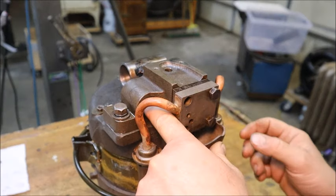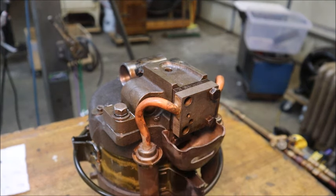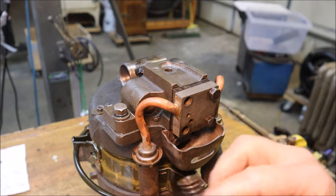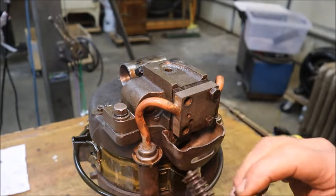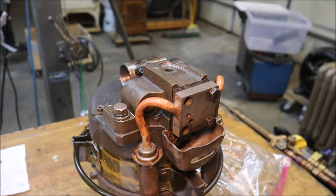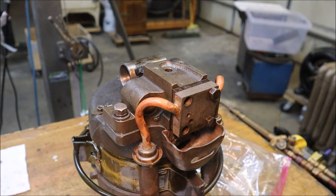When this compressor starts it lifts oil up from the bottom and pushes this piston out - that's part of its startup process. Before that piston is pushed out, this unloader pin right here goes in there and holds the suction reed open. This is engineered to work with a system that does not equalize - you can think of it like an expansion valve system. When you shut it down the high side stays high pressure and the low side slowly builds up but never gets as high as the high side, so for this machine to start back up it has to have compression release or an unloader.